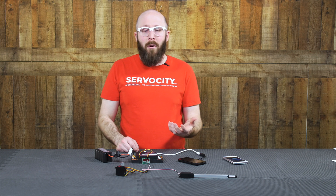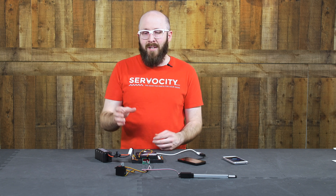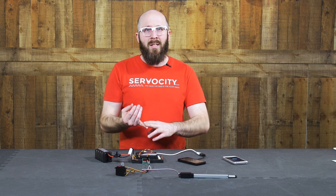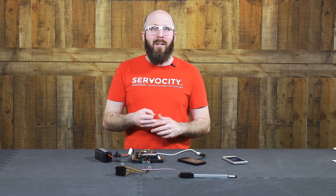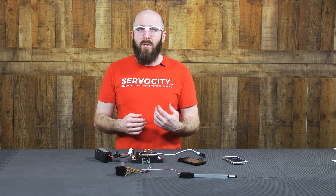When you're comparing regular motors to servo motors, you'll notice that the servo has some benefits. It's a really compact way of having your motor controller built in, a closed feedback loop and absolute positioning, making them ideal for a lot of robotics applications. Whereas a regular motor does not have those things — it's just going to rotate when you apply a voltage to it.